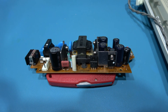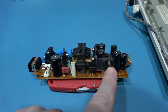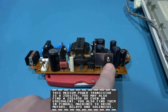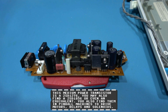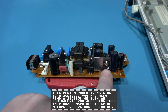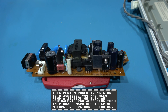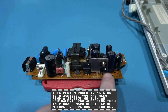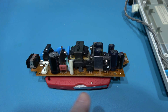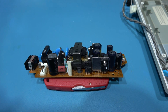What I want to do now is remove this NPN transistor. This is an NPN power transistor — this is not a voltage regulator, I just thought I'd tell you that. And in fact I'll show you the schematic for this power supply later in the video, and we'll see that this is indeed an NPN power transistor and not a voltage regulator. So what I'm going to do is de-solder this, turn it to the side, screw it back on, and then it won't be in circuit. Also underneath there's a little resistor I need to move out of the way as well.